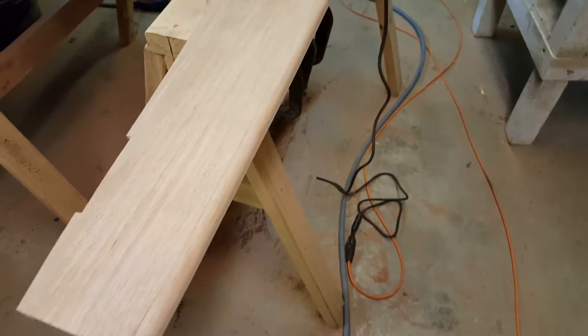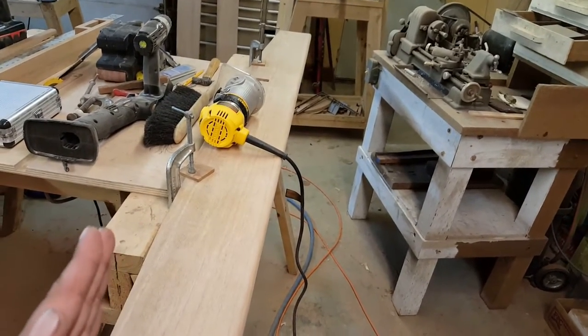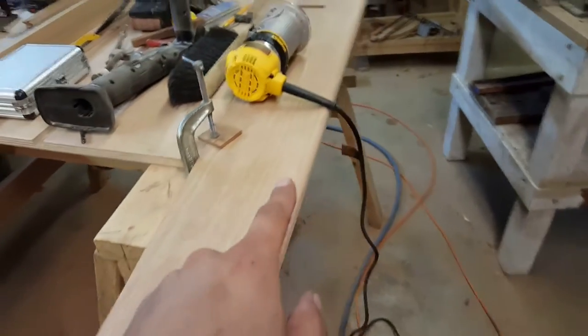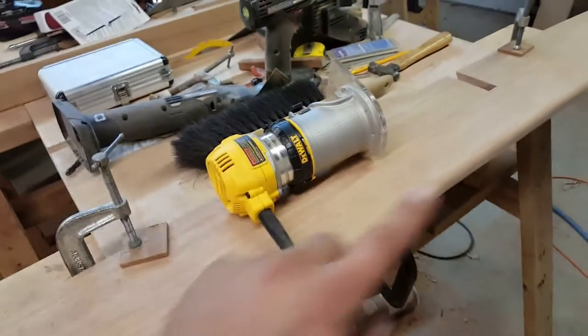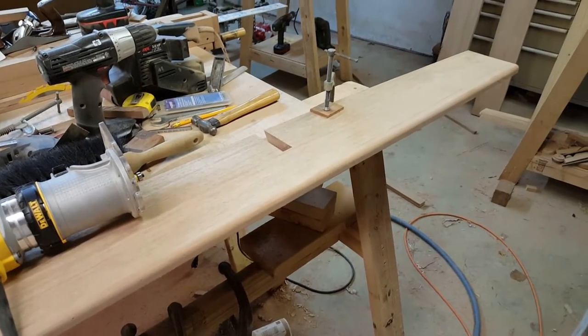Here's a look at the top board of the armrest. If you look down it you can see the curve of the hull. This notch is for the quarter-inch butt block right behind the joint where the two side panels meet. This notch down here is cut out to clear frame two. I used my DeWalt router with a three-eighths round-over bit — the exact same bit I used on the oval on the dash — so it matches perfectly.